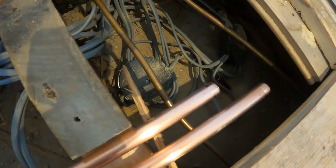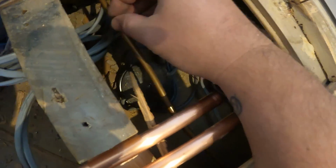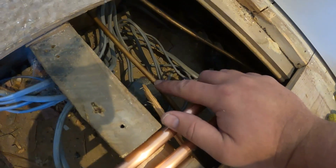8mm pipe. Horrible stuff. So what we've got to do is connect onto these two 8mm. So we'll go now downstairs to the boiler, drop the pressure out the boiler, see if we can open a rad downstairs. I haven't even looked to see if there's a drain off. Hopefully there is. If not, we'll take the pressure off it and snatch it because we've got compression fittings. But we'll go down first, check, get the pressure dropped out and see if we can do it that way.